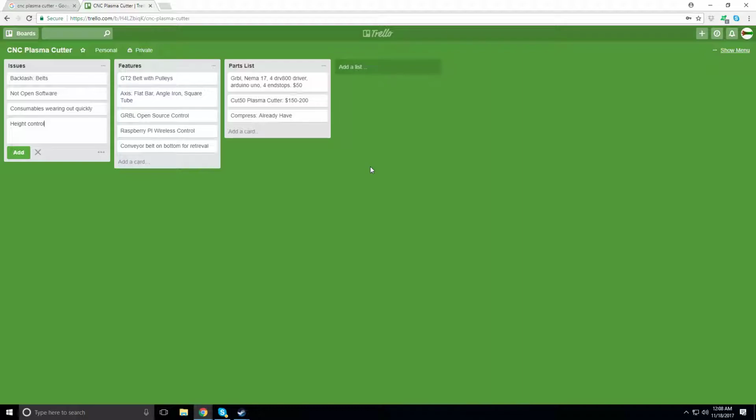You'll know that when you start to cut out, for example, a square for measuring stuff, and then you measure it against a good known square. It's not going to be square, because one side has a little bit of an angle to it, even though what you're drawing in your CAD file says it's supposed to be straight. So you're going to have that repeatability error, where depending on how long your parts are, they'll be more or less out of square.